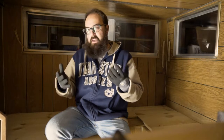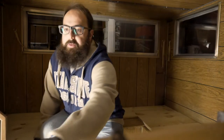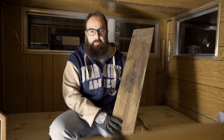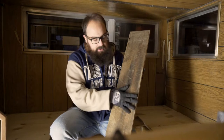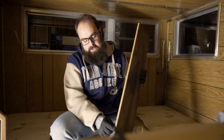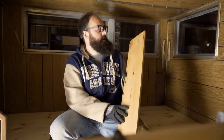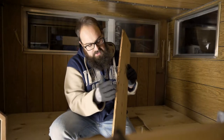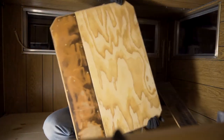Let's talk about how we made this table. We started with really thick pieces of barn wood that were up to an inch thick, pulled off a barn locally — my friend had them. What we did is we took these pieces, put them on the table saw to get a nice edge on both sides, made sure we got all the nails out, turned it over, put it through the planer, and got it down to thickness, which is about half an inch.